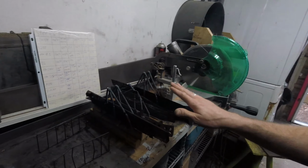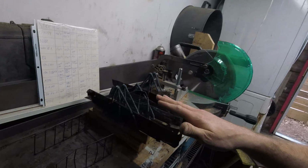I believe all of our steels today have a 2 hour by two. So we do 2 hours at temperature two times, letting them come all the way down to room temperature before doing the second one. And then some of these guys, the S110V, the M390, and the S35VN, they need a cryo sub-zero temper, so a cold temper, before we get going on the hot temper. So I'm not doing those quite yet.